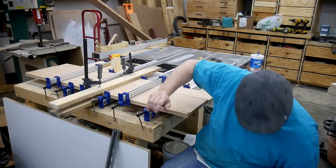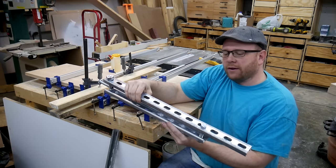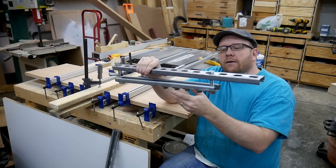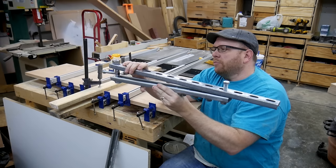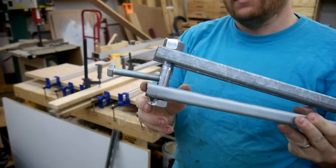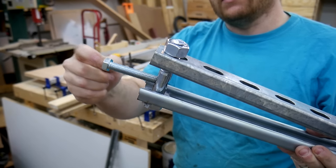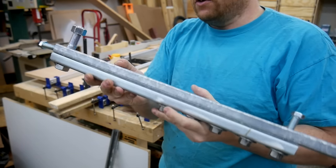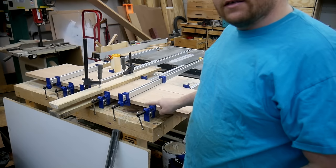So this is what I came up with. You could kind of call it a three-way clamp or something — I just call it a panel clamping system. The cauls are integrated, and you use this bolt and this nut to apply caul pressure to flatten the board. The key of this whole system is this cross-threaded bolt right here, and we can use this bolt to apply edge pressure onto the panel to make everything tight. Basically this one clamp takes the place of multiple separate clamps.